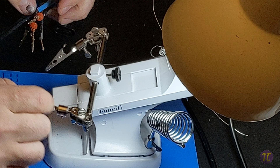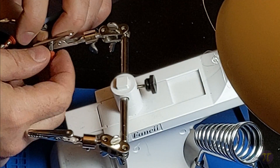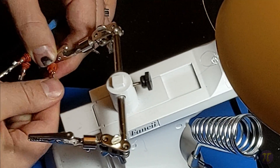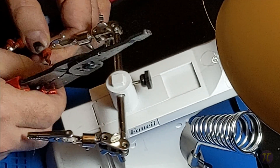Let's run through a quick demonstration on how to attach these inserts onto your power injection wire. After stripping your wire you'll place the red insert over the wire past the copper and over the existing sheath. Once that's on, you'll place the metal connector. Make sure that the connector fits fully over the small end of the rubber insert.